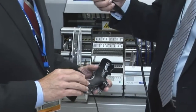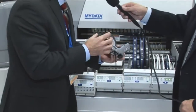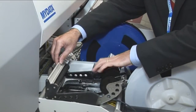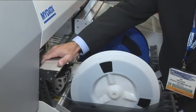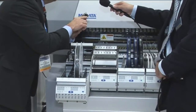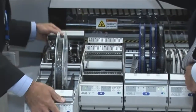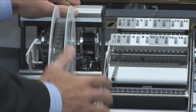Can you demonstrate how it fits into the magazine? Absolutely. What you'll be doing is taking this with the reel, with the cover tape right here, taking it back, sliding it in. From a loading standpoint, all we're going to do is take it — it's a smart feeder, we've got the barcode here. This slides right in and locks into position. Now I can take this magazine and put it anywhere we want on the machine.